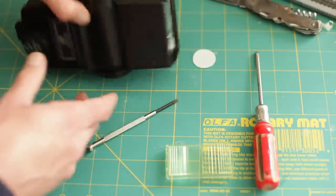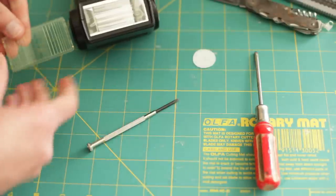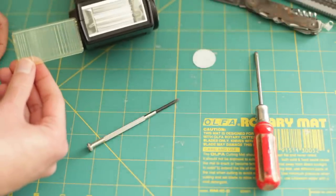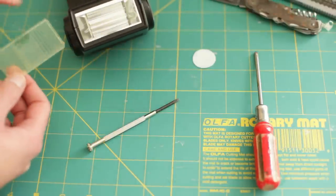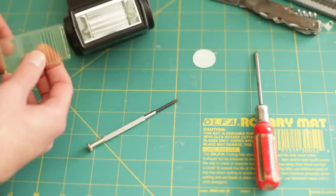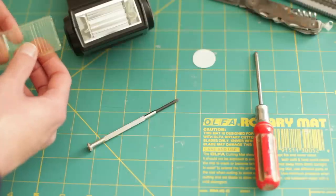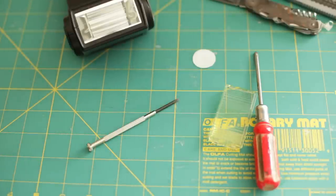Let's turn that on to M. Now you can see I've got the old fresnel lens compared to the new clear one. This lens is very good at blocking UV light - when I took a photo with this in front of one, it was black. Without it, it puts out a reasonable amount of light, although I find it's still not very much. I need several of these to get a reasonable exposure for an ultraviolet photo.